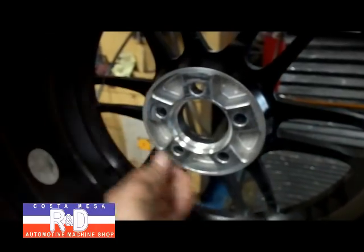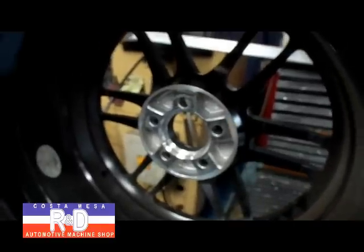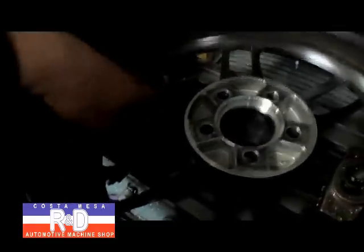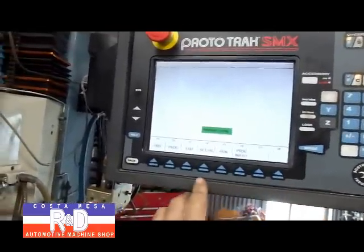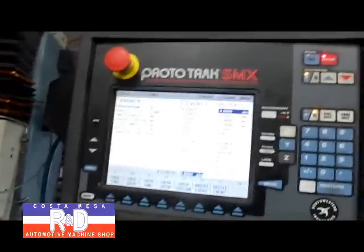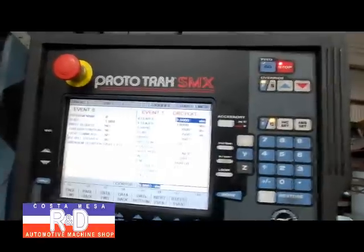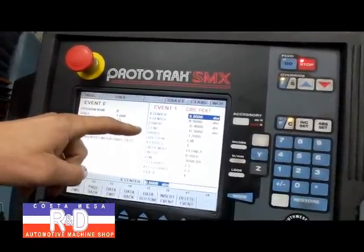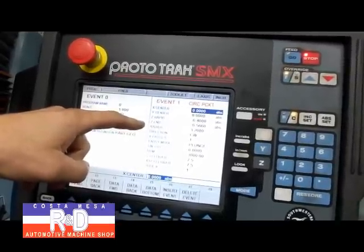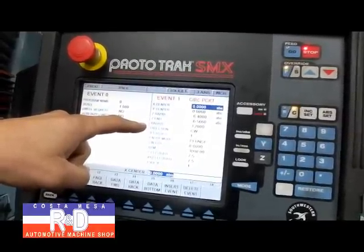As you can see there's plenty of meat on here to take off, so a millimeter and a half — or about 60 thousandths — isn't all that much. I've used a couple of simple clamps here to hold this in place, and the program I've written is a canned program that's already in the machine. Basically it's a circular interpolation to cut out a hole: zero on the X, zero on the Y, a rapid of minus 6.4, a Z end of minus 6.566, and the radius is 3.2, which will give us a 6.4 diameter.